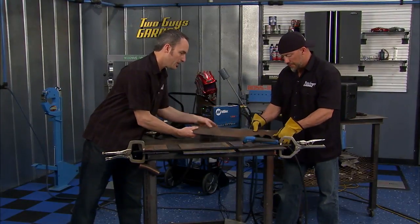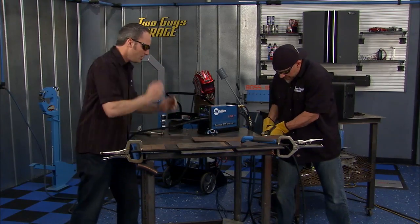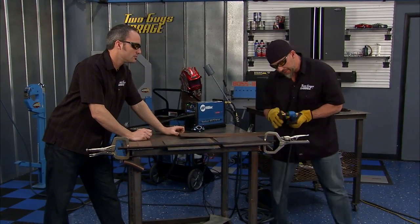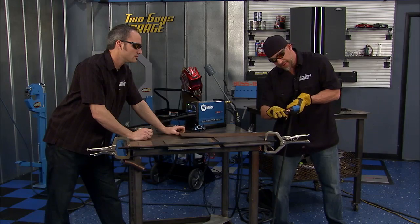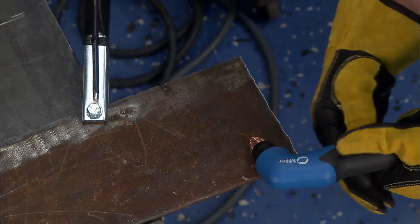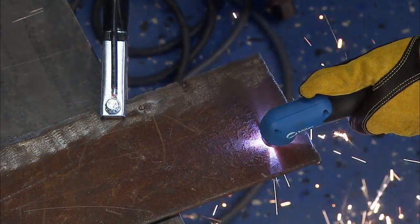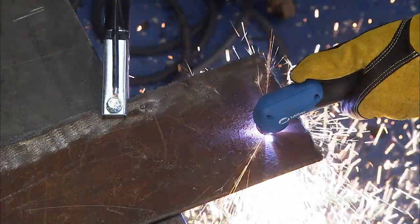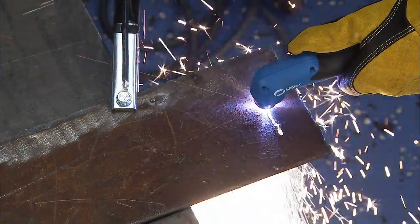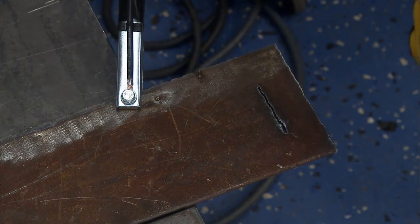Here's some thicker plate, and I'll show you a couple of these tips here. Now the first thing we're going to do is what's called a pierce delay. You want to set it in about 45 degrees, set your tip down, and then spark it, and then turn it right up and watch it dig right through the metal. Lean it up a little bit more. Now you're not always going to start on the edge. So you get that first hole started, stand her straight up again, and you can do a slot, you can cut out a pattern, you can make a hole. A really good way to start, especially in the thicker metals.